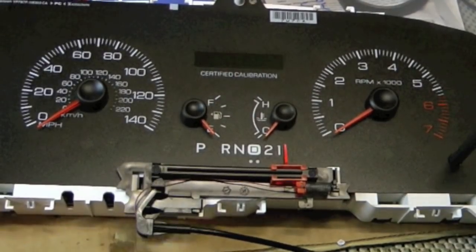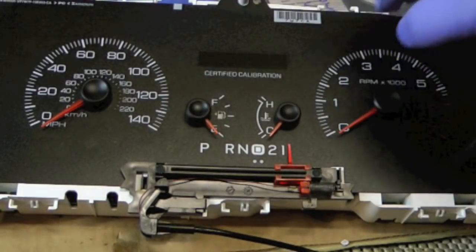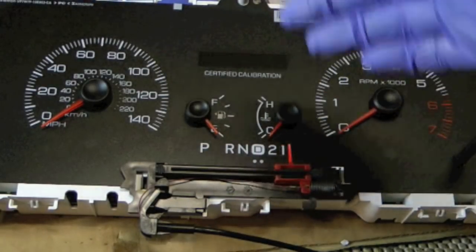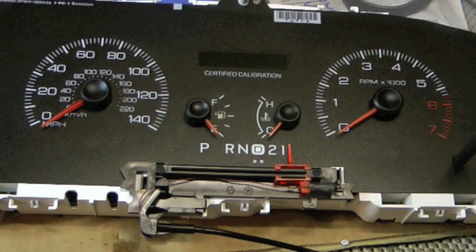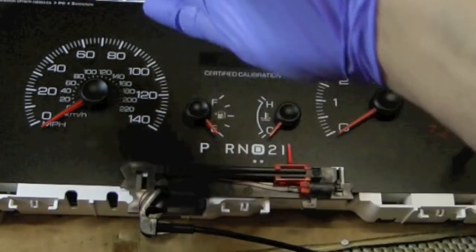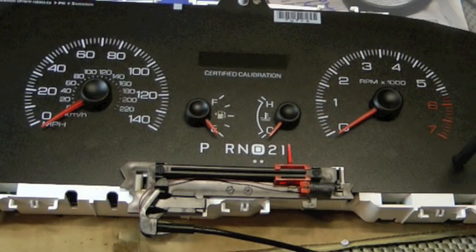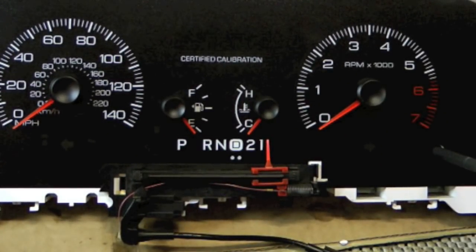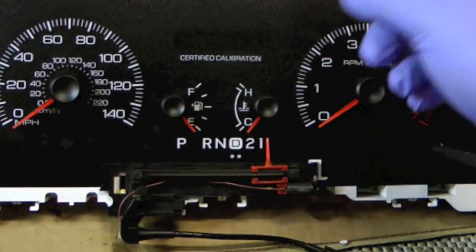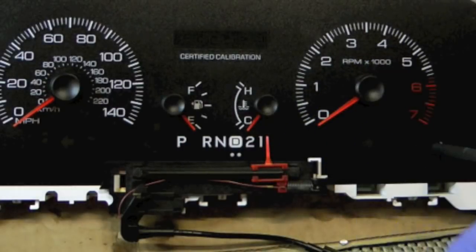The other thing is getting these dials back so they're accurate. You see these all bottom out, and you really want to get those marked somehow when you're taking pictures — marking it with tape or whatever. You can mark tape parallel to the dial, or put tape on there and mark a line on the tape. On mine — and yours could be different — the bottom points are roughly there. So when you pull those out, it's good to bottom them as you pull them out, and that way when you put them back in, you bottom them at the same spot.